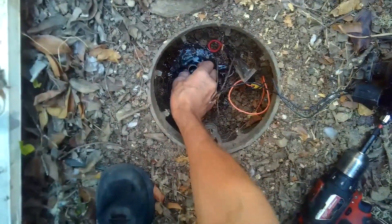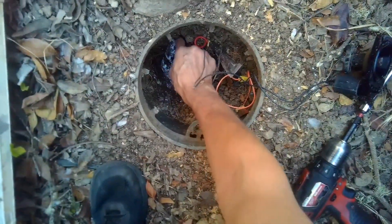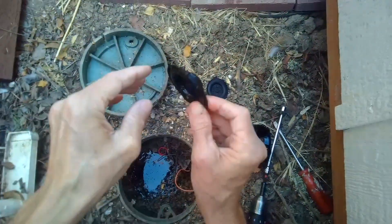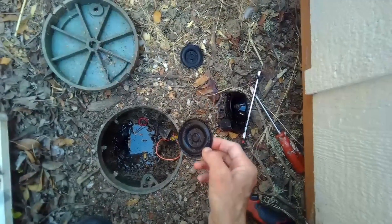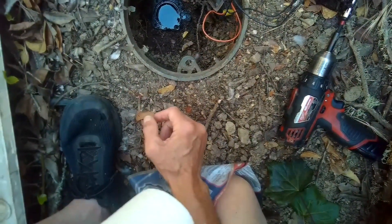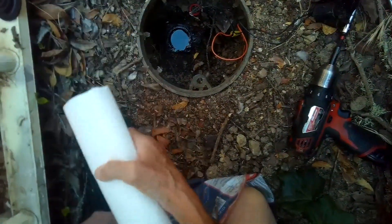The top's off. We've got a little more water coming out. Pull out the spring and then the diaphragm's below that — there's the old one. I'm going to be replacing this one. Most of the water has dissipated after letting it sit for about half an hour. I'm going to go ahead and use paper towels to get the remnant out of there and make sure there's no contamination.